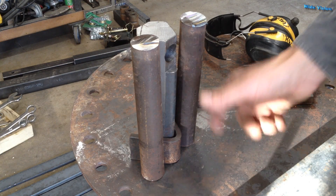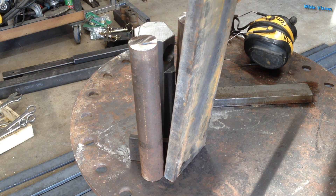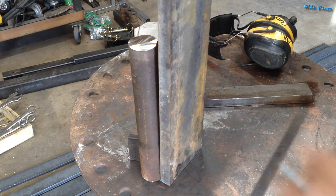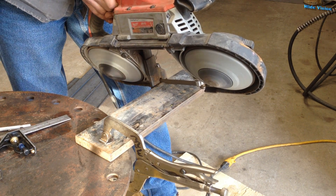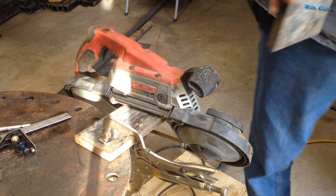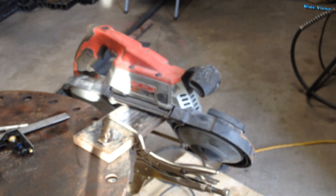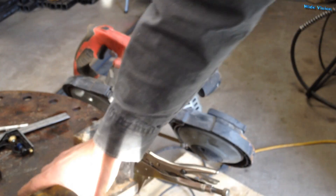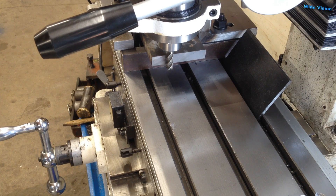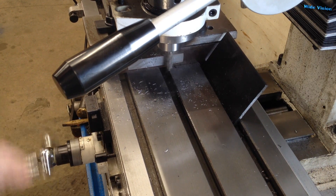After doing some measuring and going back over my sketches, I think I'm going to use this three-quarter by four-inch strap iron — this flat stock — because if I set it up there it'll be almost the center of the shafts and hold it good. I want the ends of this plate to actually be square because I plan on bolting the end caps to it, so I'm going to hit the ends with an end mill. That'll also let me find a zero on the DRO so I can locate the holes for the rods that this thing slides on.